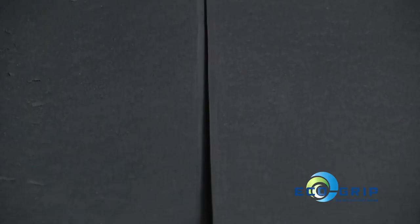If you're using the electric groover on an uneven substrate or a retrofit project, it is a good idea to use a half inch piece of plywood underneath the seams as you groove. This will prevent your electric groover from hitting a low spot, bouncing out, and damaging your sheet.